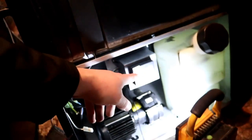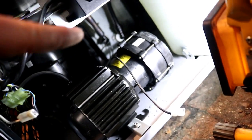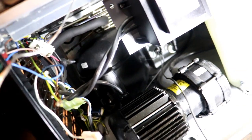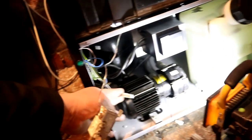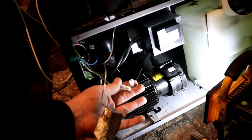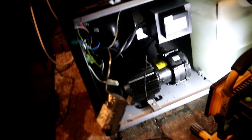You can see what we've got in here - this is the transformer that powers the heat dump outside, that's the glycol pump to recirculate the glycol, and then down at the back there is a heat exchanger. And then that there is the main compressor for the cooling system. So I'm just going to basically join this wire together and that should give us, via the STC of course, power to the unit.